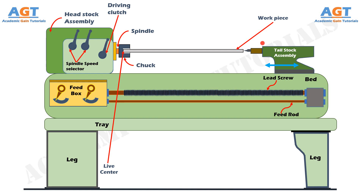This tip portion of the tailstock is also called the dead center because it just provides support and no motion is provided to this point. Similarly, on the headstock side, motion is provided to the spindle which in turn rotates the chuck and workpiece, so this is called the live center. Both live and dead centers have 60-degree conical points to fit center holes in the circular job, with the other end tapering to allow for good fitting into the spindles. The dead center can be mounted in ball bearings so that it rotates with the job, avoiding friction as it is important when holding heavy jobs.